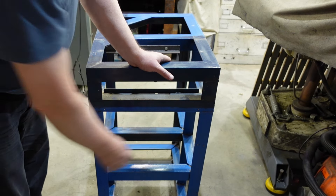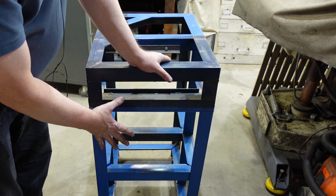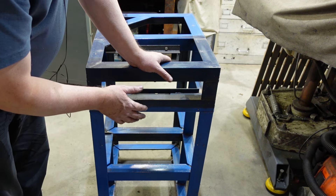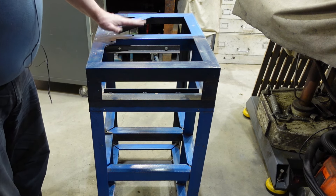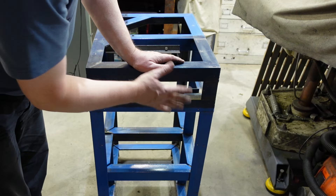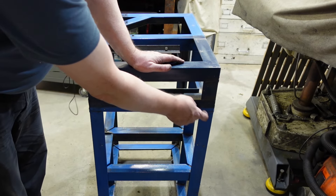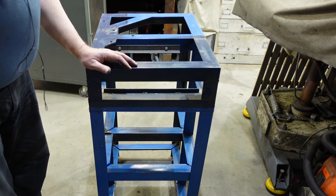The side panels were just thin sheet steel held on with some rivets. I probably could have done it with a few more rivets just to keep them flat, but if you're wanting a nice sturdy bench and that's what this was for the vice, you want it sturdy. But if you just need to cover the sides, that's not a bad trick to remember — just pop rivets every so often, and cross-crease the sheet if you can.